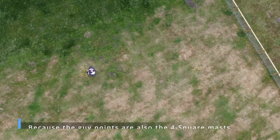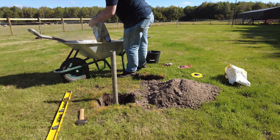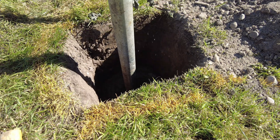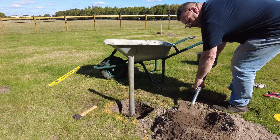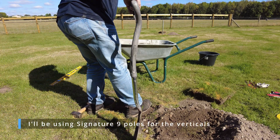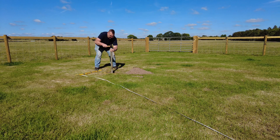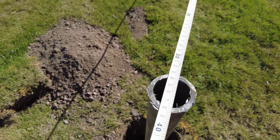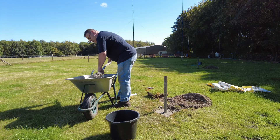So it's just a case of digging the holes. The first center hole was easy — just a case of hammering it in and making absolutely sure it's vertical. I'll use a laser leveler, cut them all accurately, drill holes, and put lifting eyes in. The guy rope I'm using is from Marlow — it's a six-millimeter Dyneema, my favorite rope — with only three percent stretch before breaking, though it breaks at tons, not kilos. I need perfect tension as the pole goes from horizontal to vertical.